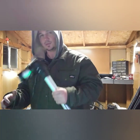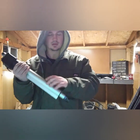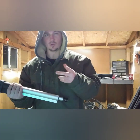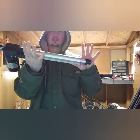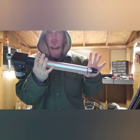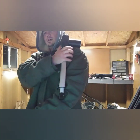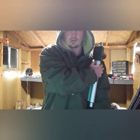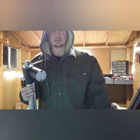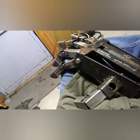Once the neck and shoulders are completely designed, we're going to start on the arms — and we have big plans. These linear actuators pull or push 1,320 pounds each. One is going to act as a bicep and another as the tricep, offset on the wires so one is pushing while the other is pulling. My actual bicep is only that large, but in comparison to how giant the power armor suit is going to be, this is equivalent to the bicep. My plan is to have two of them like this and one sitting right next to it, so both motors also act as extra protection for the shoulder. The joints will be at the pivot as usual, and I'm going to try to keep it as compact to the body as I can — but this thing is gonna be a monster.